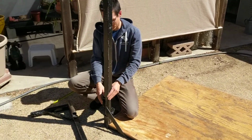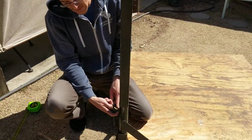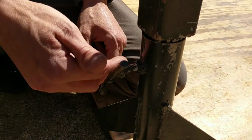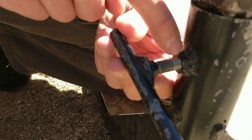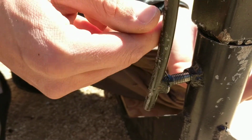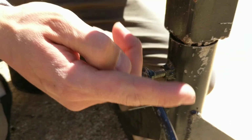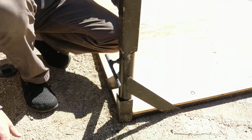You'll see when I drop the other one in, but I have this nut here that I welded after drilling a hole through the tubing. There's a nut welded in, and I just took a bolt, like a carriage bolt that matches with that nut, and I just welded a piece of metal bar across. It's just so I could do it with my hands really fast. If you're setting up and breaking down for a lot of jobs, you're not going to want to sit there with a wrench and a hex head trying to take apart your stuff. So just attach this. It just needs to be hand tight. This is really just preventing it from swiveling, so you don't need to worry about this one so much. Hand tight is fine, and then you can disassemble a lot faster.